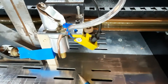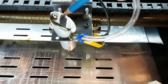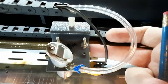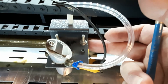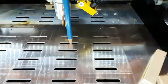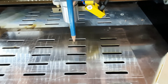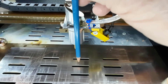By swinging this around to other points, I can verify to the best of my ability — by eyeball — that the head is vertical. The advantage to the head adjustment system I just posted the video on is that the plate is now totally adjustable. You can loosen the three bolts — two in the front, one in the back — and the nuts underneath will be only finger tight at that point. You can then make micro, virtually infinitely adjustable movements to bring the head into vertical. Along with that change, fire it up and check that your alignment is still in good shape.